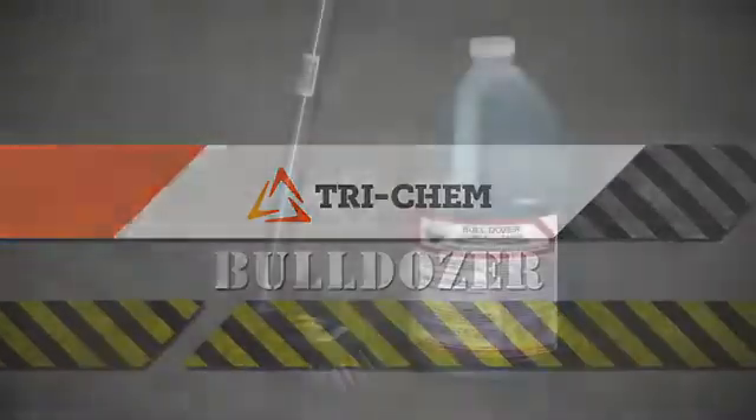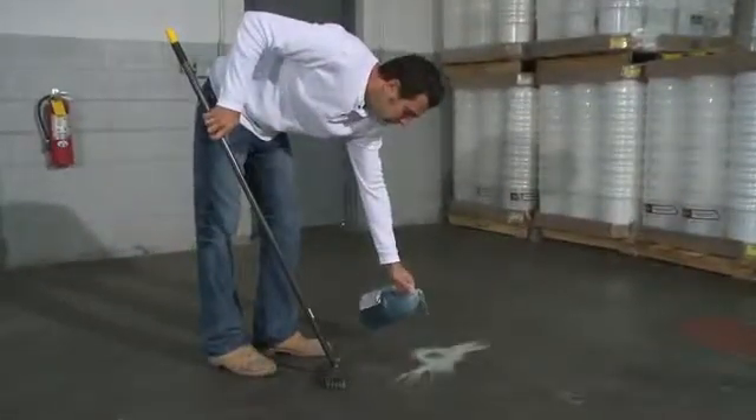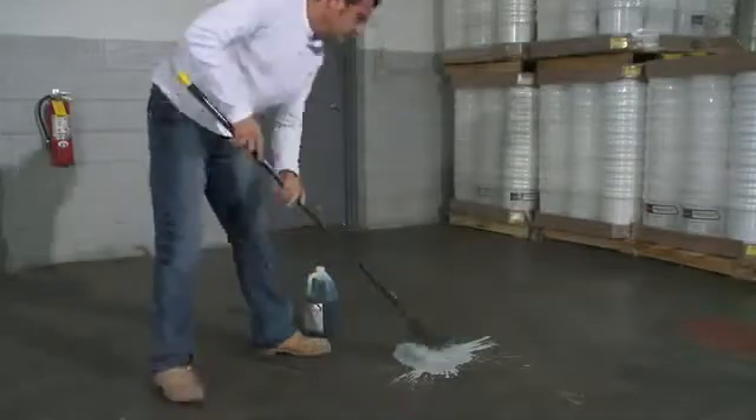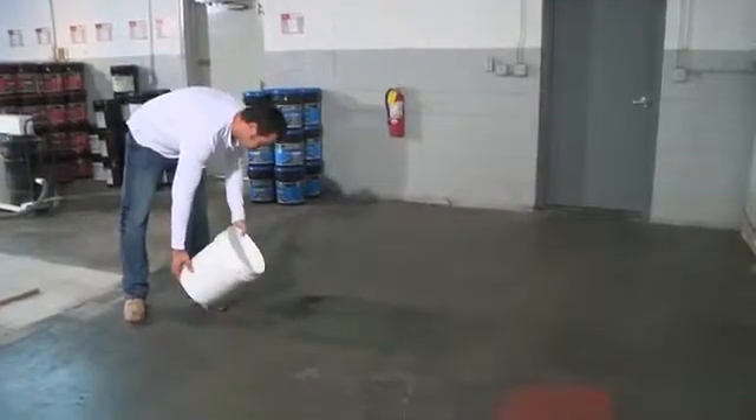Sometimes you don't have access to mechanical machinery, such as shotblasters or diamond grinders. In this case, we have a chemical etcher called Bulldozer. Bulldozer is a hydrochloric acid mixture that removes lime, rust, scale, metal corrosion, scum deposits, oil, and grease stains from your concrete. It also removes excess mortar and concrete from metal surfaces. It etches the concrete to provide a suitable surface for maximum adhesion of floor patching or sealing products. Simply brush the mixture onto the surface and allow it to sit for 5 to 10 minutes. This allows it to react with the cement and pit the surface. It will also give your concrete a clean and new look. The Bulldozer can then be rinsed or spray-washed away with water.